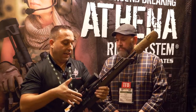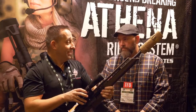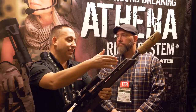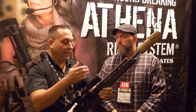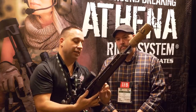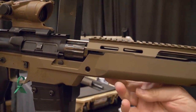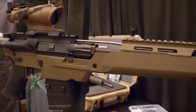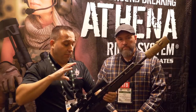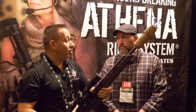What we're doing is locking the receiver set into our bolt-action chassis system, similar to a bolt-action rifle chassis, and that isolates the barrel, the gas system, the gas block — anything, even the barrel nut — from making any contact with the chassis whatsoever. We have a quick release here I can show, with a suppressor cover on there. It shows that barrel nut totally free-floated, nothing makes contact with it. We were able to get great accuracy out of this platform by isolating that receiver just like a bolt-action rifle does, in a semi-automatic.